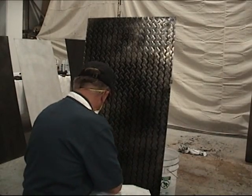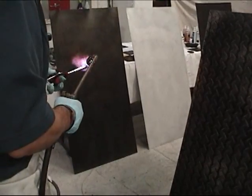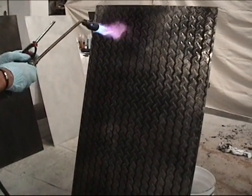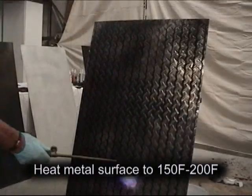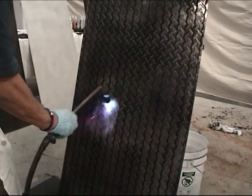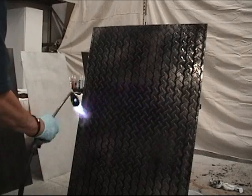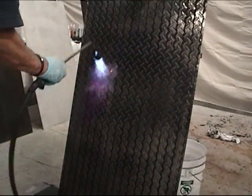Usually on those yellow dioxides, or any of the dioxides, I heat the metal up. It opens up the pores and lets the patina go in better. On this particular one, you have a very weak binder — that's on the dioxides, any dioxide — so the heat helps to bond it to the metal. Aluminum gets hot very quickly, so you don't have to really worry too much about bonding.